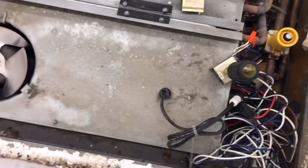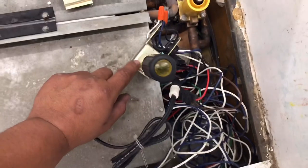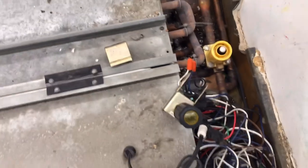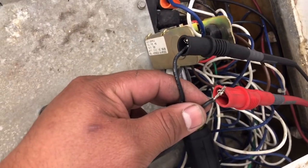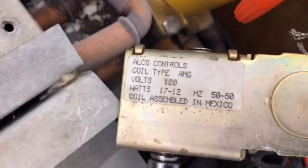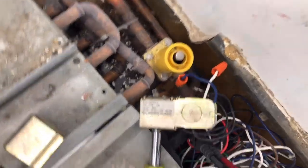This thing has been running for a few minutes now and still no fans. I checked the voltage and we're only getting about 30 volts here on a 120-volt coil — this thing doesn't have power. We're going to have to figure out what's going on. I think there might be a breaker tripped somewhere. Checking the resistance across it to see if we're tripping a breaker. It's not shorted — we got some resistance. That's for our fans right there, but we're only getting 34 volts on a 120-volt coil.